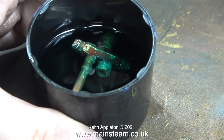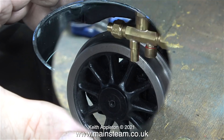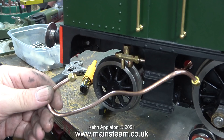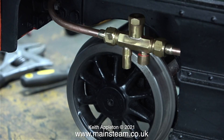Here is another clip from a different angle of the injector in the acid, taken from my main acid bath and put in an aerosol cap. Now the injector has a steam inlet, the next thing it needs is a water inlet. These pipes end up in a very strange configuration sometimes — they have to clear various things to get between the injector and where they need to go on the engine. Don't forget you must not use cones at the injector end; you use special flat fittings.